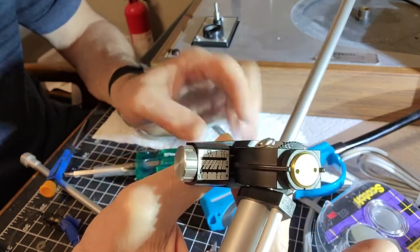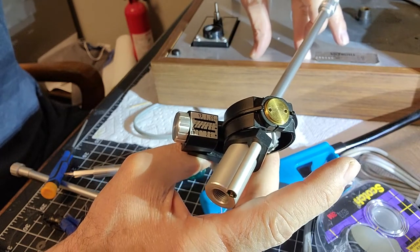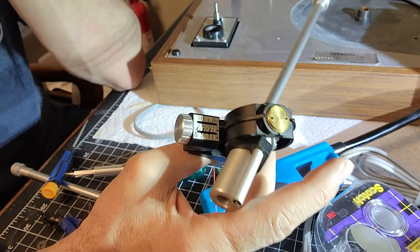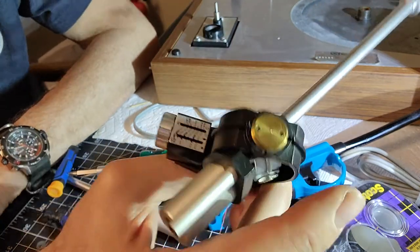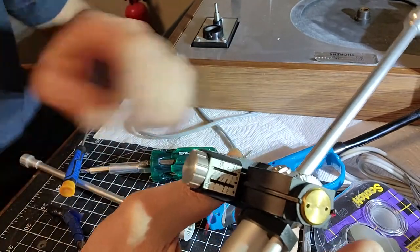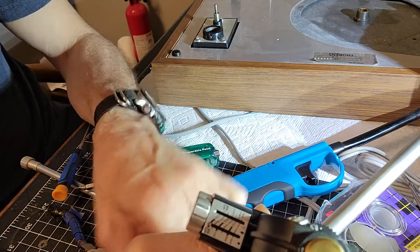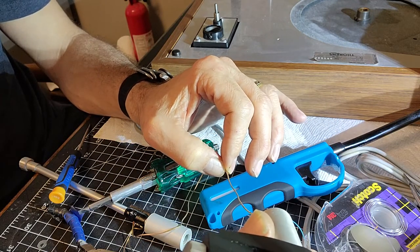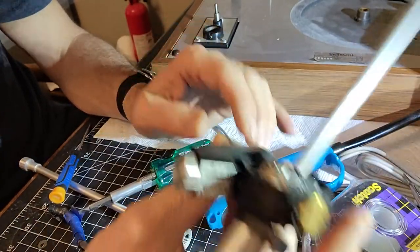It's exactly the same, it just didn't have the longer lead wires, because on here the mounting block is on the back, so this is the back of the turntable, somewhere over here. So you have to get the wires all the way over to that mounting block where the block connects to the RCA jacks. So there's one of two things I could do. I could either move the mounting block closer so I don't have to have a break in the line, but then of course there's hardware for mounting that mounting block, and that could get a little bit dicey. Or what I can do is take all of these lead wires, and take enough length to get me over there, and then just extend them, and try not to get any breaks in the line. Either one, it's not ideal, but it is what it is.